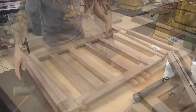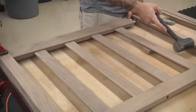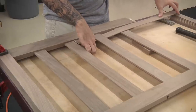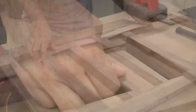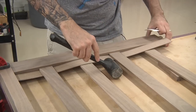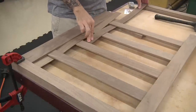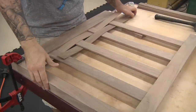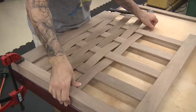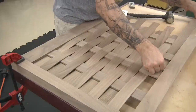I'll begin by doing a dry assembly with both rails and both legs. For extra support, I'll clamp one leg to the assembly table and remove the other leg — the only reason I attached the second leg was to get everything aligned properly. From the open side, I begin weaving the eighth-inch strips in. It's a little awkward at first, but you quickly get the hang of it. I found that rocking the piece back and forth made it easier to maneuver into the groove. I want a little spacing between each piece, and a Wood Whisperer sticker seems to work just fine. The second strip goes in the same way, being careful to alternate the over-under pattern. This is very repetitive, and after working through all the strips, the last one can be a little tricky — you'll need to unclamp the panel to make sure it's captured into the groove.